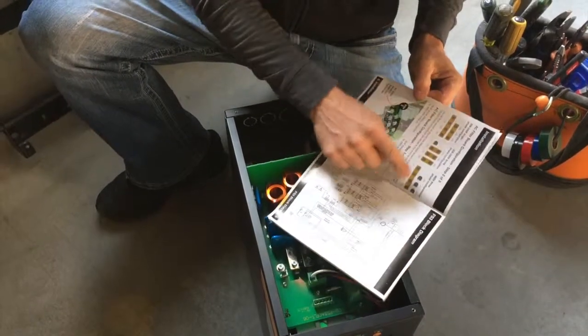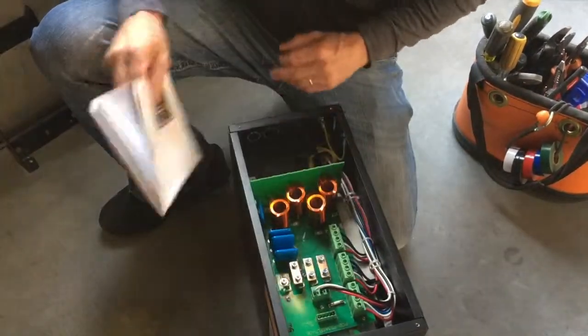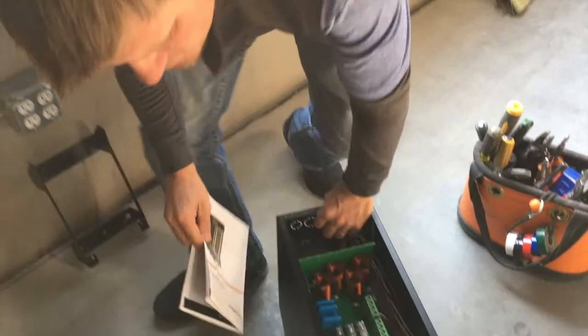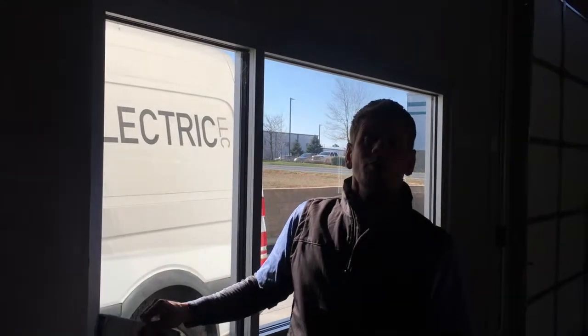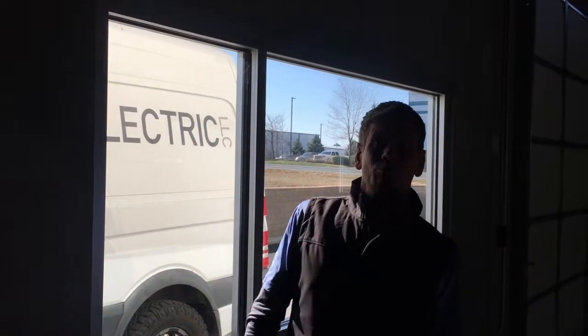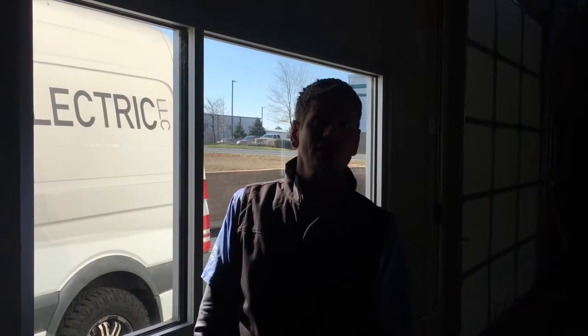Now I know I can change that myself in the field. Again, pay attention before you hook up volts so you don't fry anything. The biggest thing is they would have liked 480-volt three-phase on this, but they would have had to set up about a 10 or 15 kVA transformer just to step up the voltage.